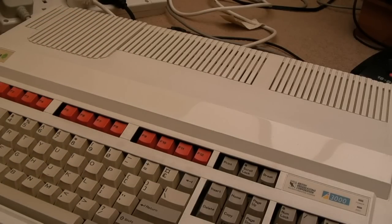Now, this is interesting because it sort of echoes something I thought and said in the past in a few videos, that sometimes with yellowing, it's not necessarily that it's been in direct sunlight. You get the yellowing because it hasn't been in any kind of light. Does that make sense? I found that with some of the things I retrobrighted, for example, Game Boy and the front of the GameCube. When you put them in a dark environment for 3 or 4 months and then get them out, they've yellowed again.